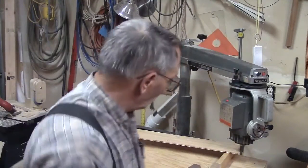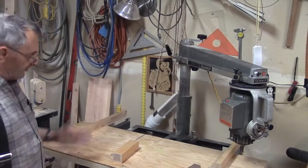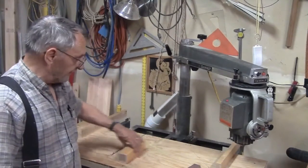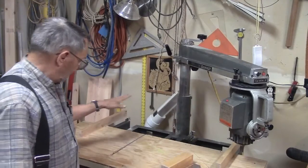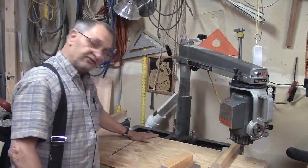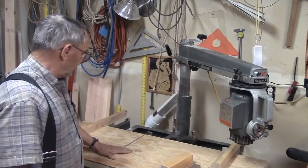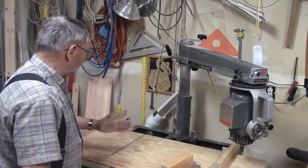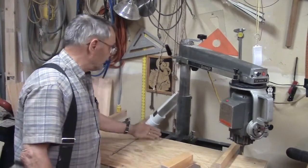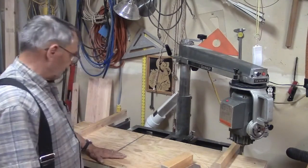The other thing that happened was I had purchased a new blade with a wider kerf. I'll do a review on that blade maybe next video. And so I cut a new kerf in, but before I cut the new kerf in, I patched the old kerf with epoxy, let it set, put in a new kerf. First I adjusted the saw, readjusted the saw, and tested it to make sure it was absolutely square to the fence. And then I patched it, then I cut in a fresh kerf.